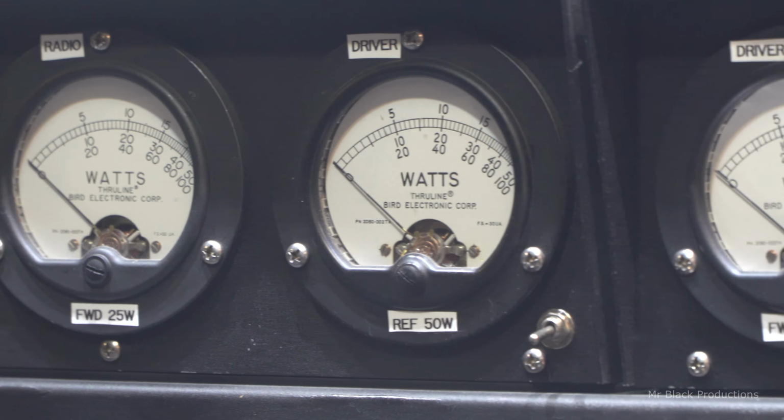Because we run primarily unfused electrical systems, and we're wanting every little bit of juice that we can get out of this. This alternator is technically not big enough to fully support the load that we're going to apply to it, but we're going to bolster its ability to do its job with supercapacitors. So this is an uncut run that runs from here. And then we've got it following along the harness, going up underneath the body of the truck. And about every 6 to 8 inches, we got a zip tie, and it's supported, and there's no rub points.